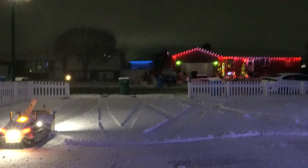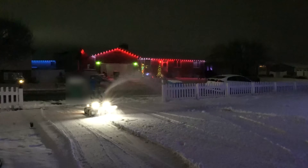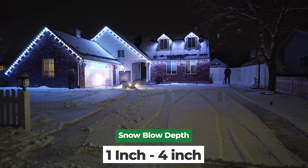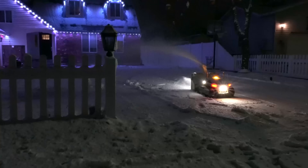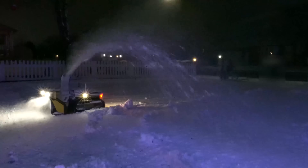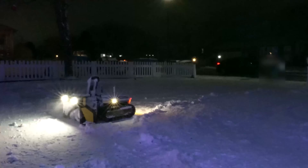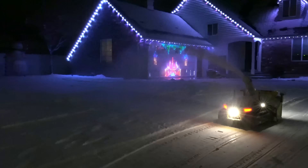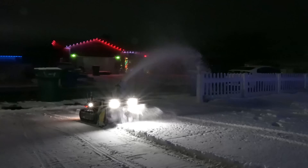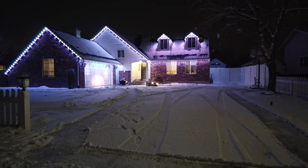The third piece of advice: this is a maintenance machine. It's capable of pulling off snow that's 12 to 15 inches deep — I've personally done it — but that's not what it was made for. It's made to take anywhere between one and four inches of snow off the top and repeat the job over and over. It's not a person — the machine does not care if it has to go over a space three or four times. It's better to run this machine multiple times, even in one night, than to run it once with very deep snow.